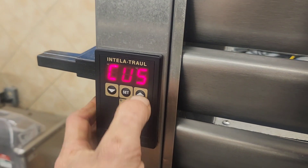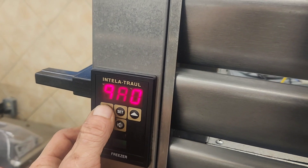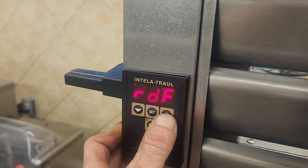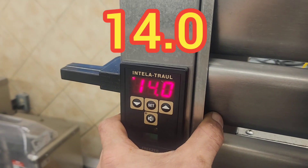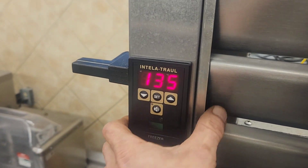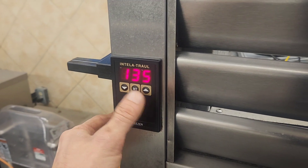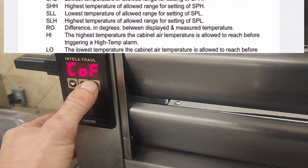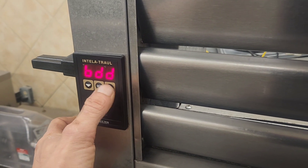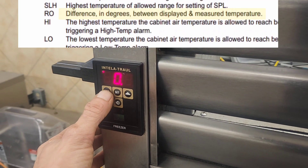Now I've got it running again. Going in through 99E — you can also go in through menu A10 or A01, it's in the manual. Now my sensor for the evaporator shows 14 degrees, and the cabinet sensor shows 14 degrees — roughly the same. Earlier my display temperature, the CB, was showing 2 degrees higher than what my gauges were. So I went in and changed the RO — which is the display temperature offset — you can go negative 2, positive 2, or whatever and adjust it. I did that earlier, so I'm undoing that now.